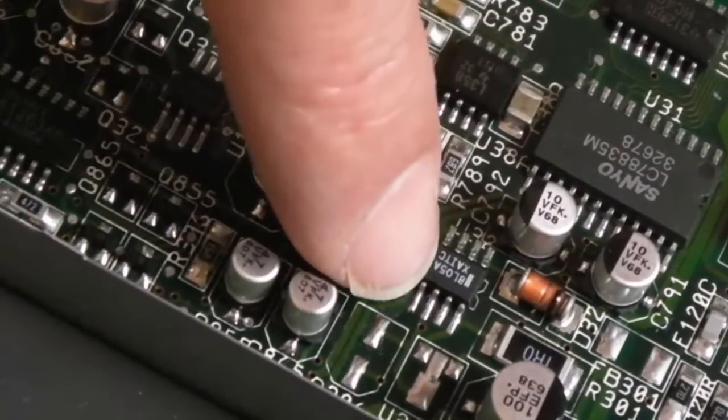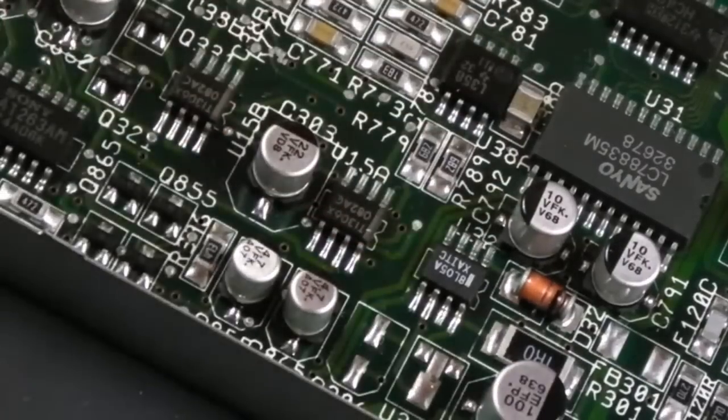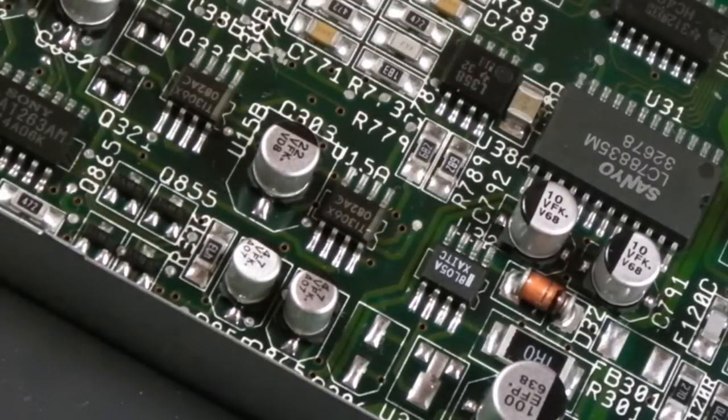I'm going to fit a 10 microfarad cap on there. And the reasoning is, looking at the schematics, I see no reason to not have that cap there. And if it's good enough for 1200, why is it not good enough for the CD32? Yeah, the CD32 is basically a 1200, so anyway, yeah, these are quite small. I think I dropped it, so blooming small. So they're tiny, these. I've recapped Mega CDs with these in the past. But it's the right voltage, 16 volts, 10 microfarad.